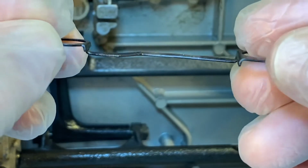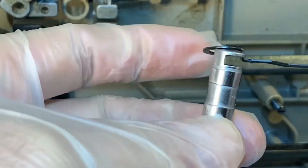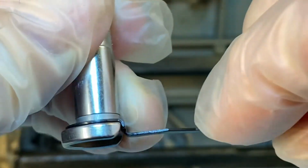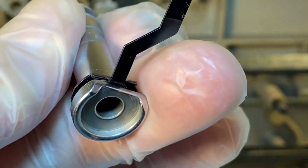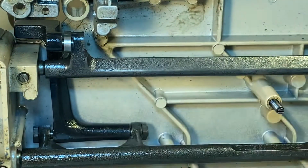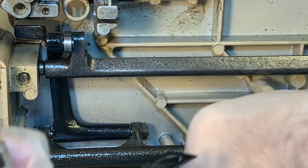there you can see the shape of that bracket, and the way it'll work is that that one will go like that, and you can see how the bracket seats onto the end at the bottom, and that end at the bottom is also flattened on that side. So that ensures that when we install this in the tubes in the bottom here, they will line up correctly so that the slots in the tubes are facing inward.